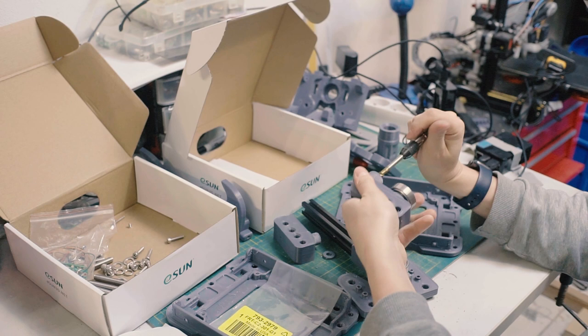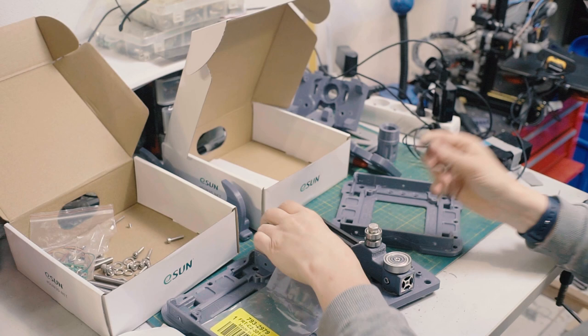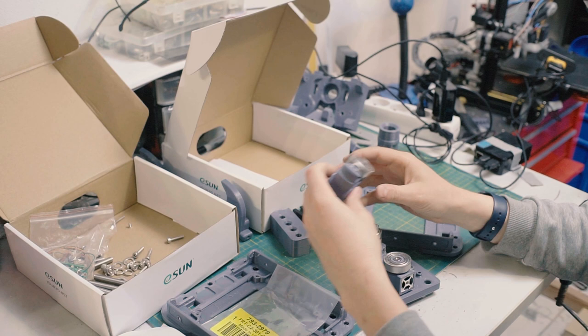You're tempting fate. You know, and even getting a broken tap out of plastic, not a big deal, but just don't do it. It's just a bad, dirty habit. It promotes, you know, recklessness with these tools, and then it'll snap on you, and then you'll be completely screwed trying to get it out.